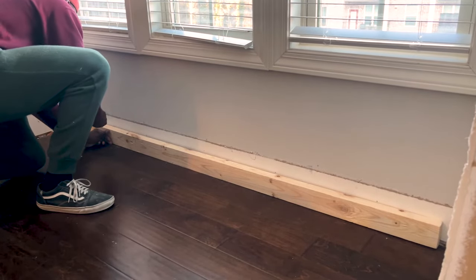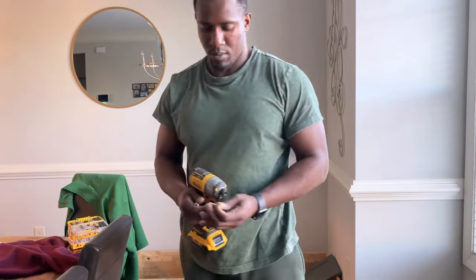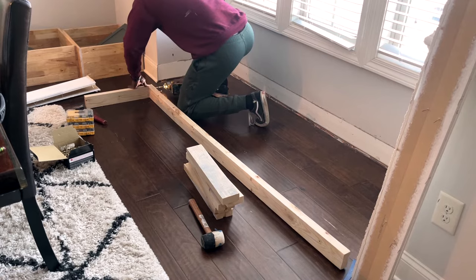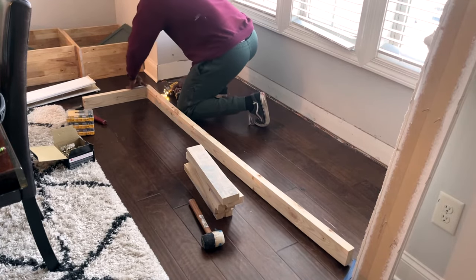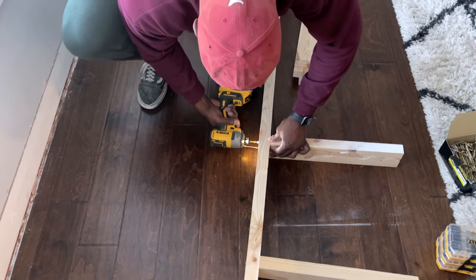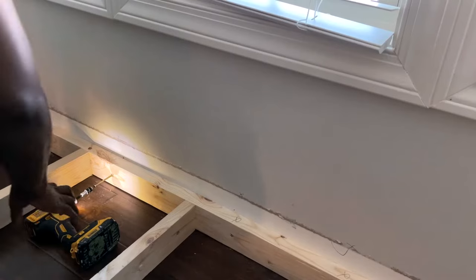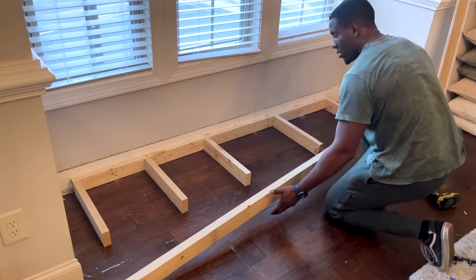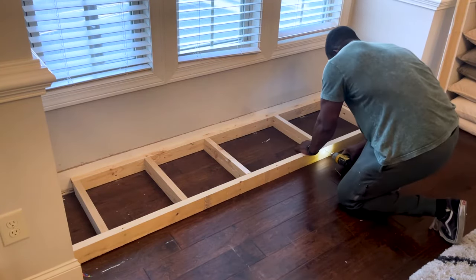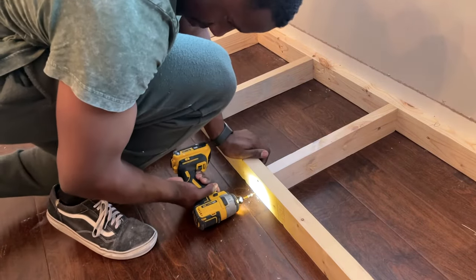I take my back plate and mark where all the studs are located so I don't put any rail in that area. We're using Spax screws — three-and-a-half inch to go into the studs and three-inch screws to install the base together. We mark the stud locations on the 2x4, put the rails together, then transfer the base to the wall and screw it into the studs — about two screws per stud working down the wall. I keep the front piece separate so I have room to install the base to studs, then screw the front on using those three-inch construction screws. Easy peasy lemon squeezy.